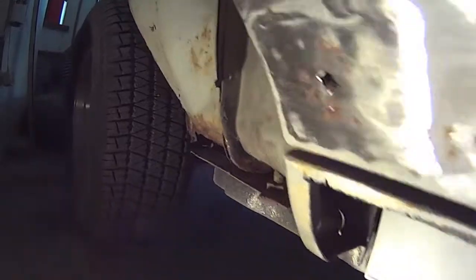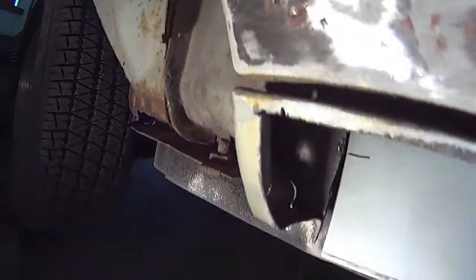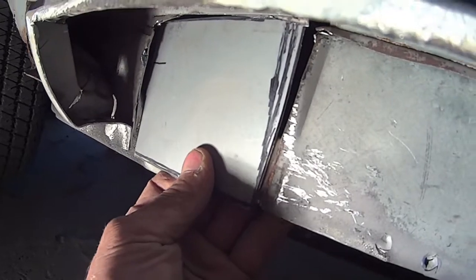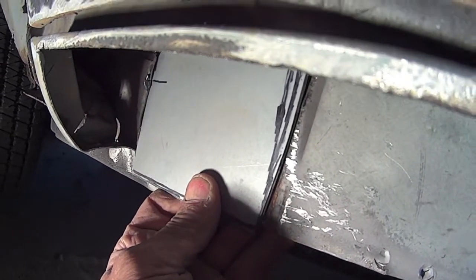And then the floor pan is in reasonable condition. There's some spots, some over there. It's got a lap here. I'll probably cut it back here somewhere and replace this, but I'm going to do that later. I just want to continue with this rocker, get this rocker done. Once this rocker's attached, then I can start making my way back again. I don't want to get too carried away here. I can come back to this later, the floorboards and the cowl here. Still got to do a little trimming there so I can get a good fit for a butt weld.